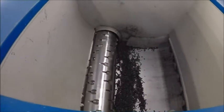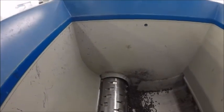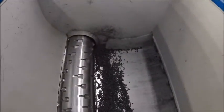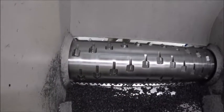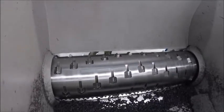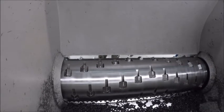This is the inside of the chamber, and this is fairly easy to clean. As you see along the back wall there, there's a half moon. You'll need to get a brush in there and brush out all the material that's going to hang up in this whole area and in the corners. Those knives in the front of the rotor have a knife plate — we basically unscrew those plates, rotate the knives, and clean out any material that may hang up in that area.